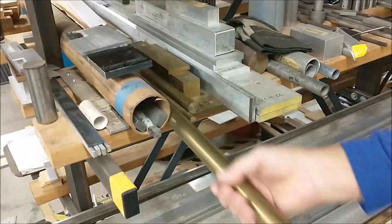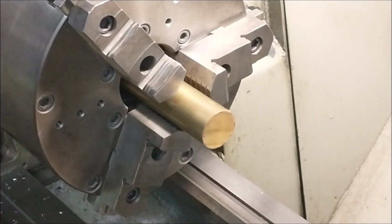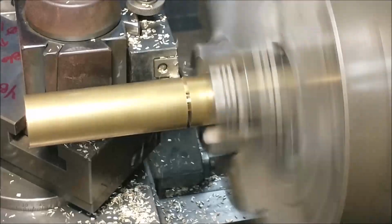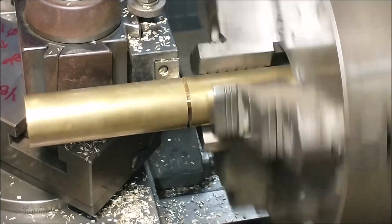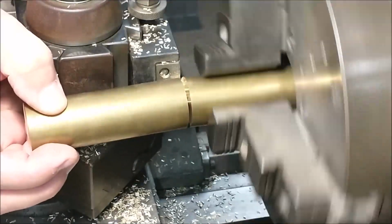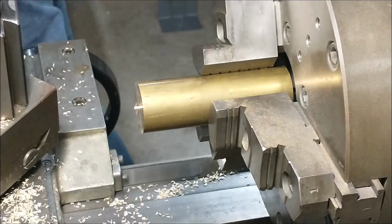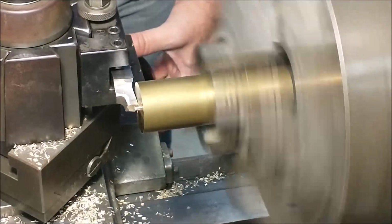The wheels will be fabricated from 1¼ inch diameter brass. It's about a 3.5 foot, 4 foot long bar, and it's not the same size as the hole through the spindle, so it will be oscillating and flopping around. That will translate to the finish and dimensions. If you're going to catch a piece like this while the machine is spinning, bear in mind that it's spinning towards you and could pinch your fingers between the part and the tool block, so be very aware of where everything is. Working with a shorter piece like that is much easier and friendlier.